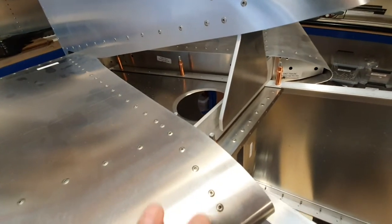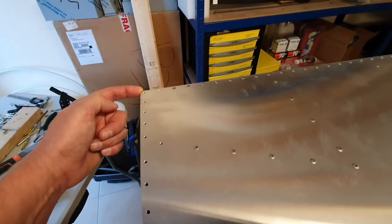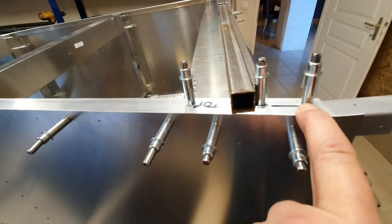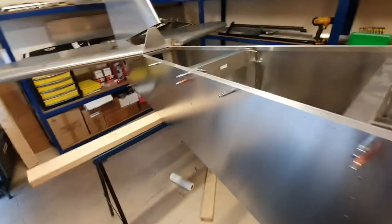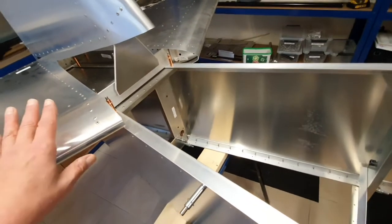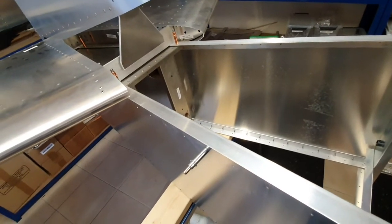Getting it square: I've measured from the back corner of the horizontal stabilizer to this cleco on both sides and it's exactly the same to within a millimeter. I'm happy with that - it can't not be level because it's sitting on those so it's got to be level. So I'm going to go ahead and drill those holes, get that positioned, then strip the tail cone down, deburr all the holes, and reassemble it.